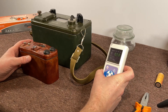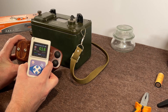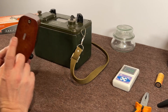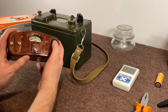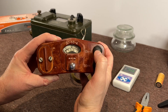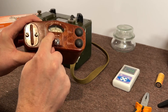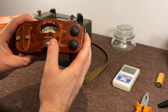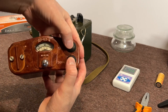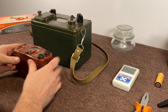As I show you here, there is very, very little if any residual radiation from this. It's still got the strontium-90 check source down there. That is so that this unit can go to zero on the 1.5 scale — so the strontium-90 source allows this to go to zero on the 1.5. There's a battery inside it. If I press both buttons at the same time — there you go — it passes its self-test.